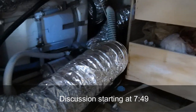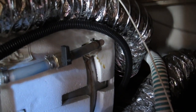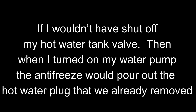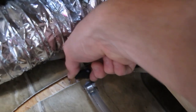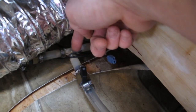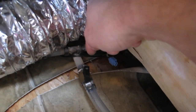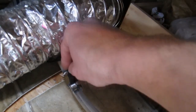I also shut my hot water tank inline off — here's the inline going to my hot water tank, I shut that off too. Remember: if the valve handle is sideways, that means it's closed; if it's going with the flow, it means it's open. You can see my flooring starting to crack — the linoleum cracked after a cold winter. Gotta replace it this year.